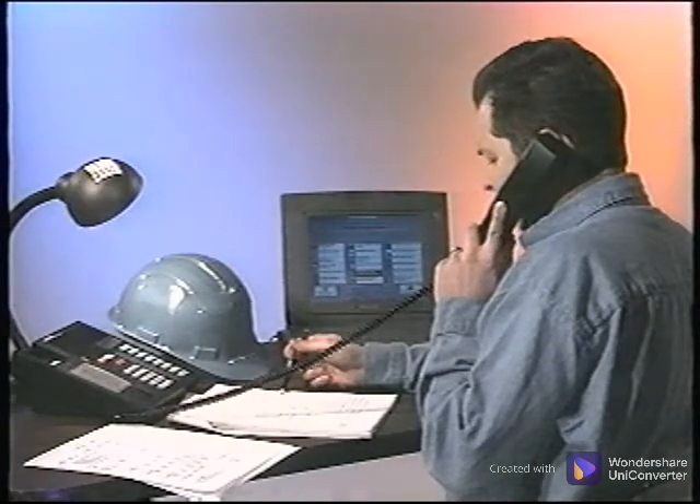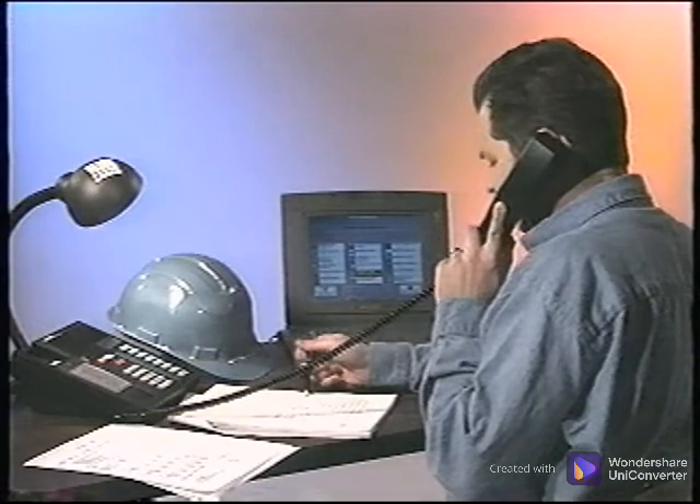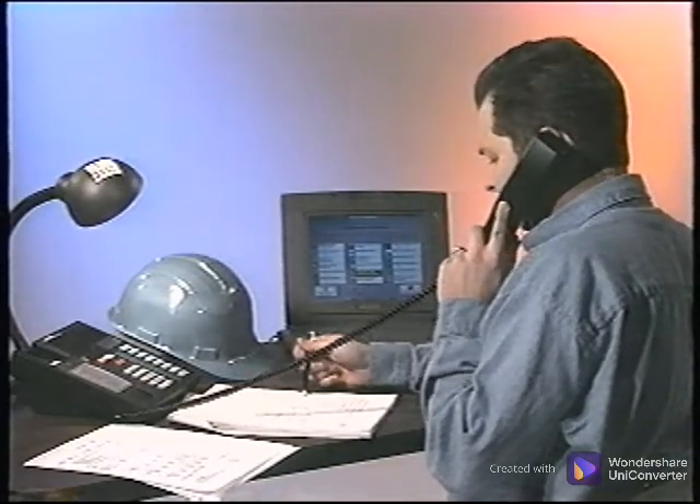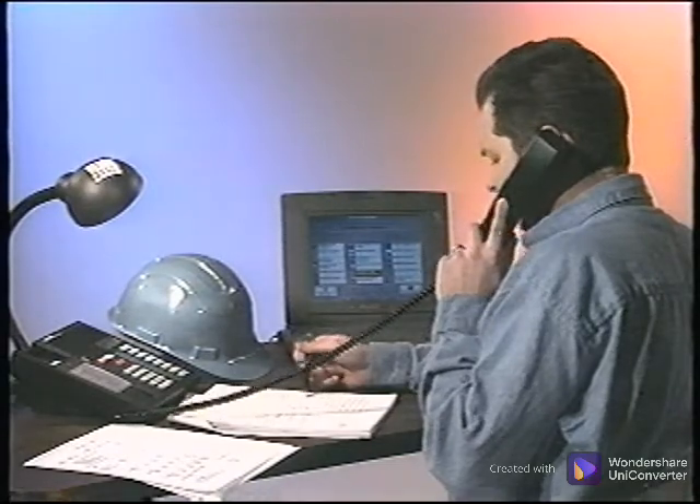What makes you think the fan has a balance problem? It's shaking pretty bad. So it's never run smooth since it was moved to that part of the plant two years ago? What was the last work done on this machine? This is a very important question, because more often than we'd like to admit, the last work done on the machine is the reason the machine is not running as well as it should be. For this fan, no work has been performed on it since it was placed here, except for some attempts at balancing and replacing belts.